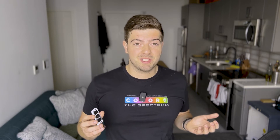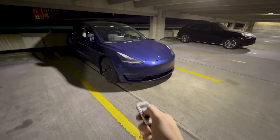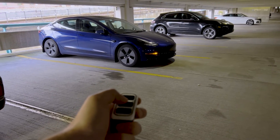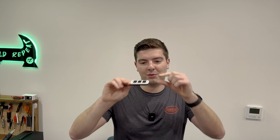But I'm pretty happy with the final result. So with the design mostly stable, I decided it was time to do some proper testing. I went out and just used it every day for two or three weeks. A big part of that testing was making sure it worked with all my outfits. With that very important testing done, all that was left was to push those buttons a whole bunch more times and make sure everything still felt good. Thankfully, the worst that was discovered in testing was an issue where there'd be a low battery warning that would pop up on the car. Turns out this was caused by the top case lifting up just a little bit, allowing the battery to slide and disengage from the contact. All I had to do to fix that was drop down the top wall just a little bit so there was no room for it to move at all. So all things considered, pretty easy fix.